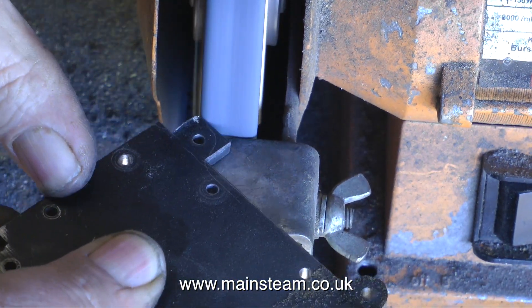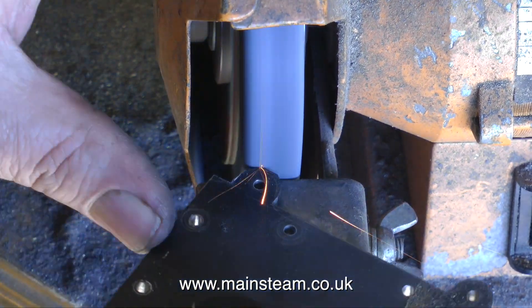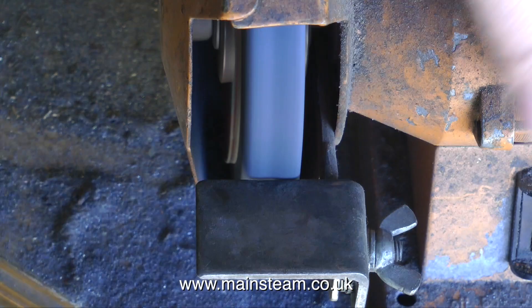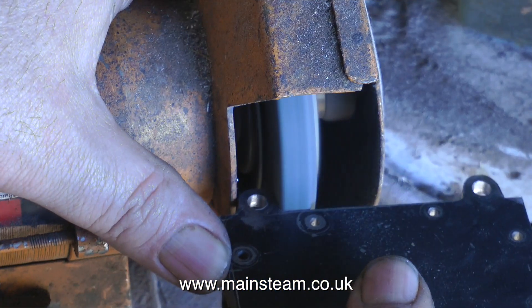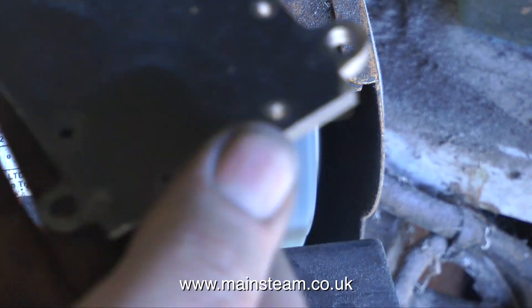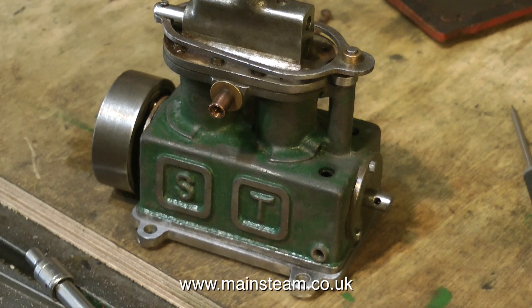You can also see that the little grinding machine moves all over the place — that's because it's not fastened down, and that's a health and safety no-no. Grinding wheels should always be fastened down. Mine isn't, because I need to move it around to accommodate different sizes, and that's a very bad thing. I cannot recommend that anyone uses a grinding machine of any description, whether it be a rotary or a belt type, without it being bolted down securely to the bench. That was a health and safety warning.